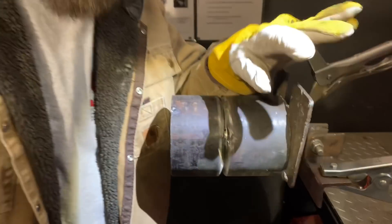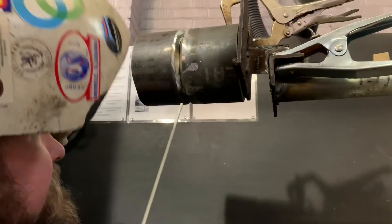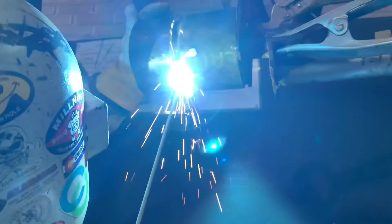This is going to happen real fast, so make sure you're paying attention. We're having a little bit of cameraman issues — he's always in the way. Our settings: we're running anywhere between 80 to 95 amps, depending on how big the landing is. The arc force needs to be on a machine that has arc force control — anywhere from plus 7 to max arc force — and you can adjust your amps accordingly. I usually do all my adjusting for amps and arc force when I'm doing the tacks, and that gives me a good idea of how the machine runs and how the rods are.